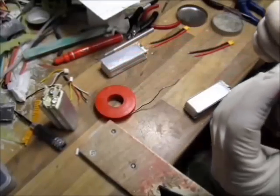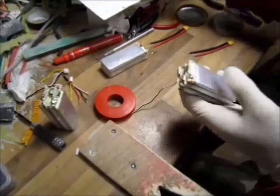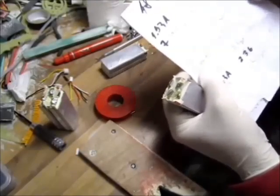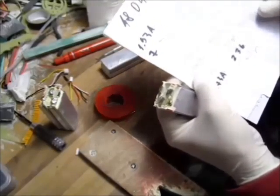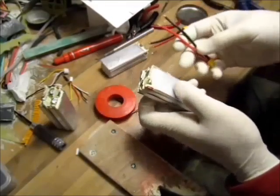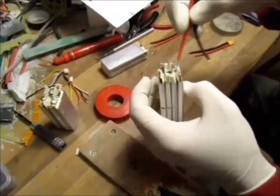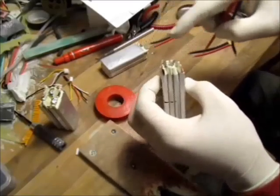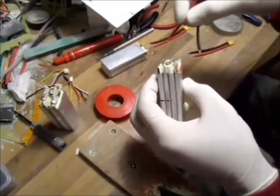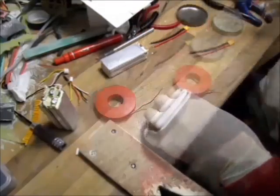I will be reusing the same wires. These are the 16 AWG wire gauge. Basically, I have my motor prop test data here. Maximum at full throttle draws 9.06 amps, so that's 36 amps across four motors. So 16 gauge wire should do, because it's going to be very short, plus where the power wires are going is short as well. So 36 amps should do enough.